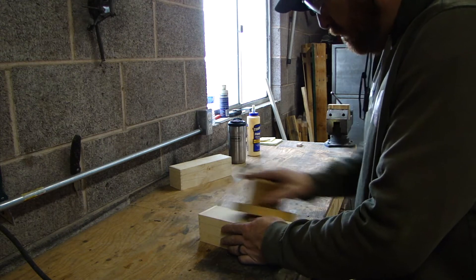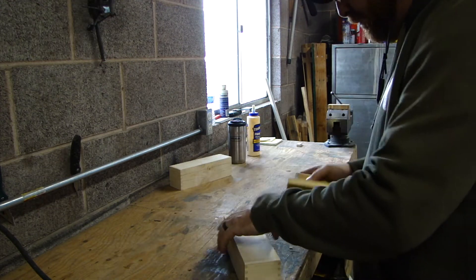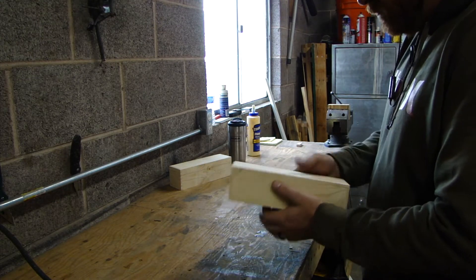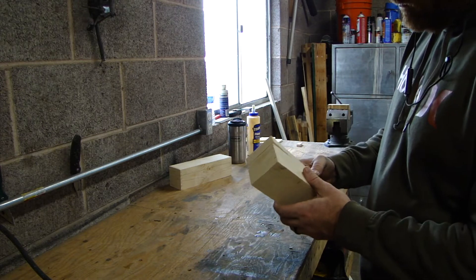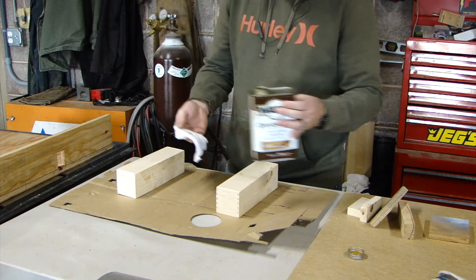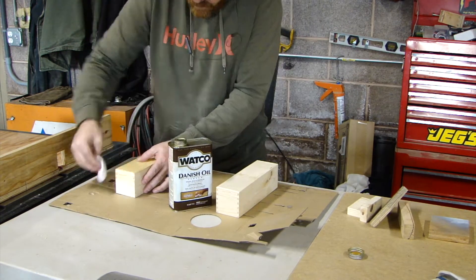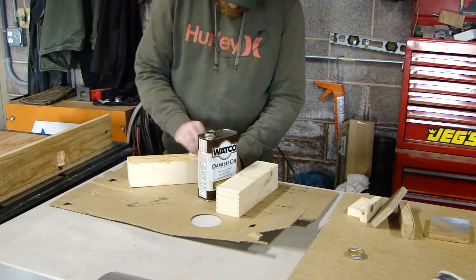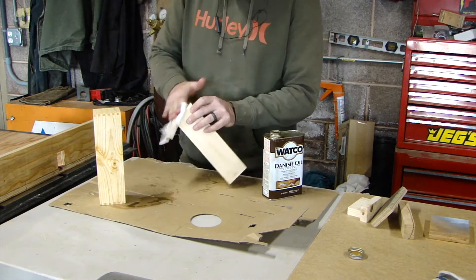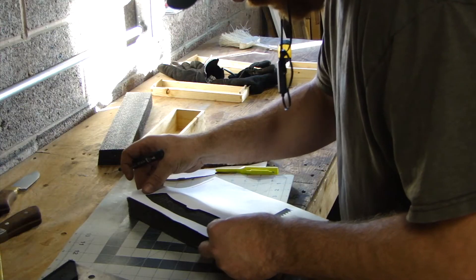As I mentioned before I left the sanding marks in from the disc grinder. What I'm doing here is just rounding the edges so no one gets a splinter and they're nice to handle. Just going around both boxes with this little handmade sanding block. There's one sanded up and ready for a finish. I'm just putting some Danish oil on these boxes — just a light coat, I only did one coat and liked how it looked and how it turned out. These are not going to be heavy-duty outdoor storage boxes — they're just kind of a one-time use gift box, or you could do a keepsake box the same way. Setting them on blocks as they dry.